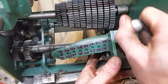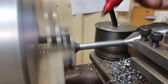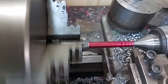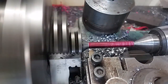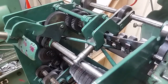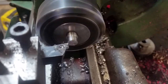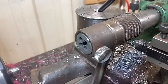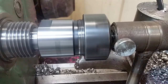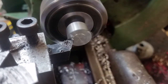Now onto what I'm calling the threaded plunger. The head of the plunger is too big and needs to be assembled inside the body later, so the plunger needs to be assembled in two parts. Now to turn the head, I'm going to use the threaded section of the plunger as a threaded mandrel.